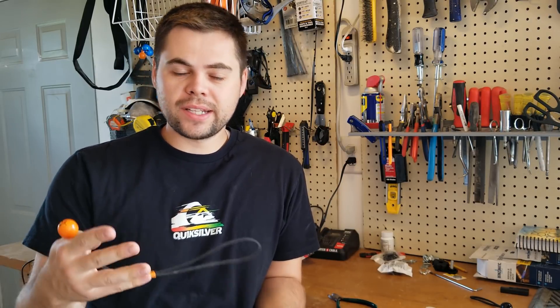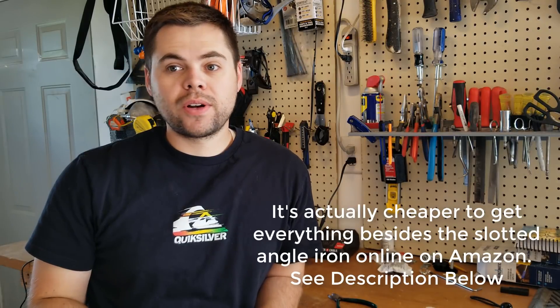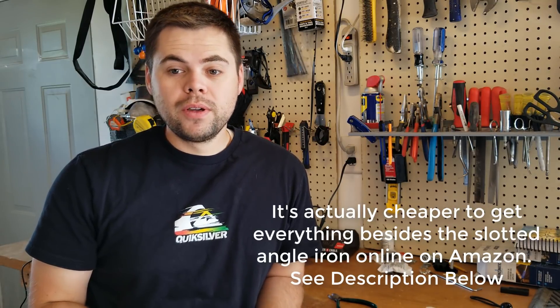That's the solar panel stand — really easy to set up and take down. In the end I think it cost me about $140 for everything. The aluminum angle pieces are about $100; you don't want to go for the 22-inch kind as those are too short to support the panels — get the five-foot angle irons from Home Depot or Lowe's. The bungee balls you can find at Home Depot or Harbor Freight. Use quarter-inch thick bolts to fit through the holes. This is the cheapest way I found to mount up to five solar panels, and it works with rigid panels too, though the hardest thing with rigid panels is you can't use bungee cables to secure them.